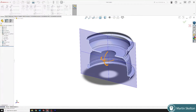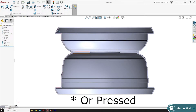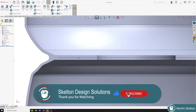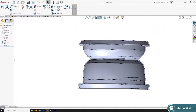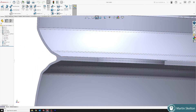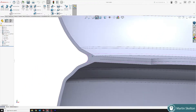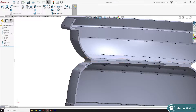Let's start with the wheel rim. As I had said, the wheel rim is actually two parts - two components that is probably spun metal. We know our profile comes down around and lands in. This is a representational profile, so the representational is not the hero. The hero we are trying to achieve is our whole outlines for our hub and our exact width across and our exact depth of the wheel, plus the position of the hub attachment. Our rim is split into two. We've only one surface body, so when we have one surface body, we can apply the fillet to represent the weld between component A and component B.